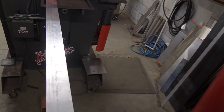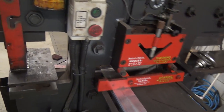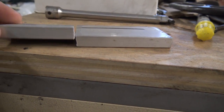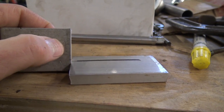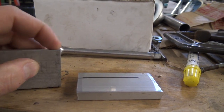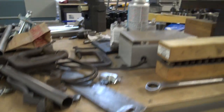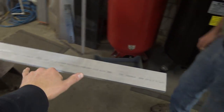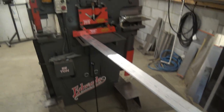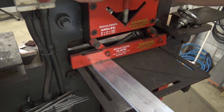What I want to figure out is we do a lot of work machining flat bar aluminum. And when you shear something, you do deform the edge. We were experimenting this morning here, kind of looking at what happens to the edge. You get some deformation on the bottom — see that little part there — and you also get a little bit on the sides. So that's going to mess up if you have to put say this whole part into a jaw. But some of the stuff we run, like our Bridgeport power draw bar kits, the part is longer than the jaw. So some side deformation won't necessarily hurt, and we clean up the ends anyways. So we'll start here with some shearing and just show how freaking awesome these things are, and we'll take a look at the cut quality.